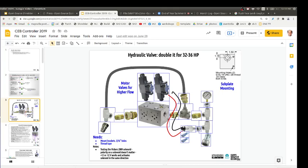So that goes into sizing of your hydraulic tank. Say you have some big cylinder with a fat rod on it that's pretty long. You better have enough spare volume in your hydraulic fluid tank so that when the excess fluid from one side versus the other comes in, you're not spilling your tank. So typically we just go with a 5 gallon hydraulic reservoir. That's never been an issue in things like the brick press or the backhoe that we built and other things. Effectively, the question you ask is what is the differential volume of fluid, as determined by the volume of a rod in your longest cylinder, times how many cylinders you've got. You basically have to count up rod volumes.